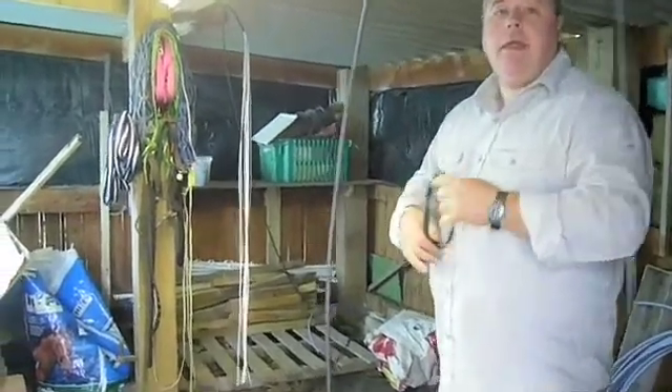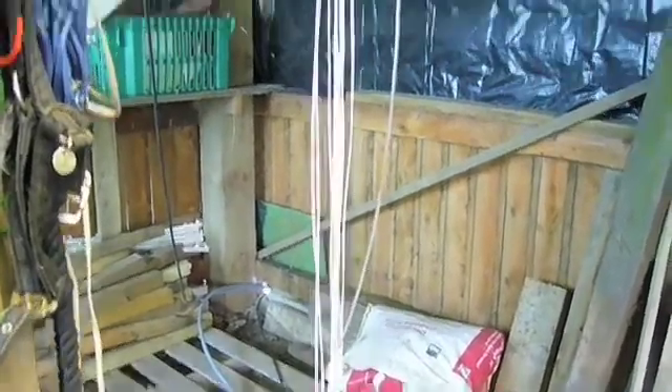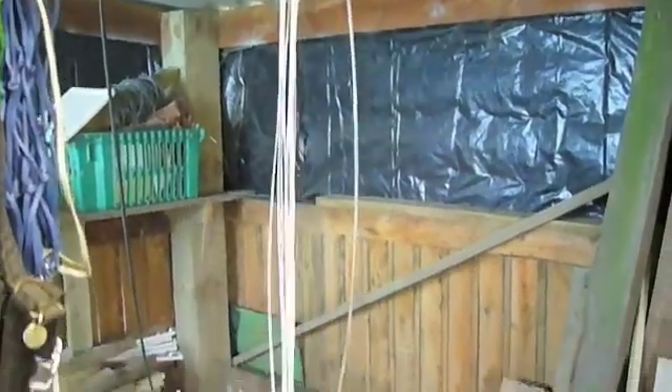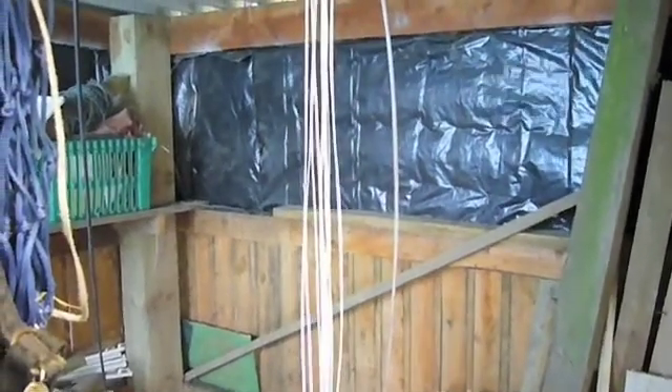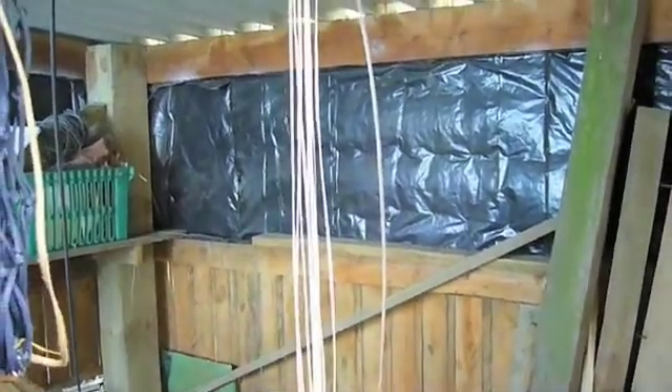What's happening with the cable now? You're just stripping the cable. So both cables are coming in through the ducting in the corner of the shed here. And the fibre is being stripped. It's got the end things on — the white floaty things are high tensile filler. And the rigid plastic thing is the sheath that the fibres are in.